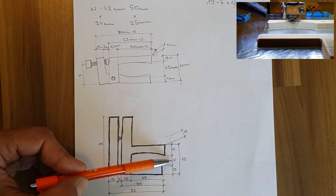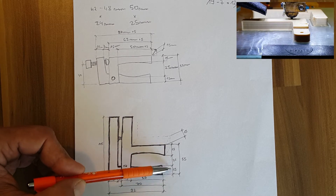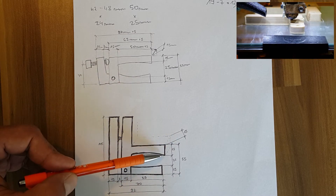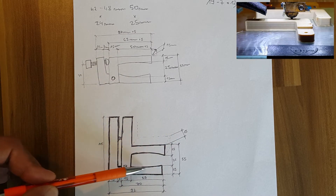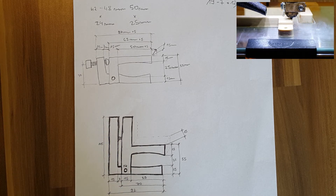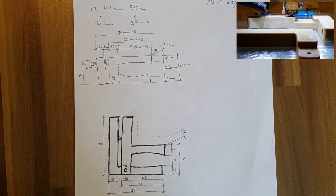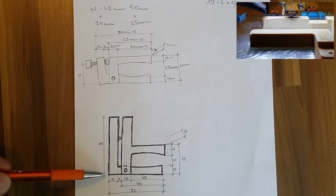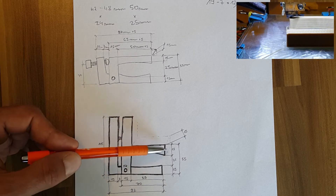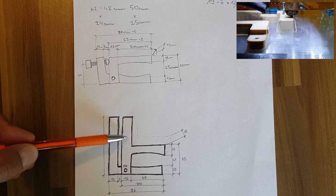I put the arms 25 millimeters apart. Each arm is set to 15 by 15 millimeters. On each arm on the inner side I set a different radius, so the capo would fit different guitars and the whole neck if necessary — just flip it around. The handles are approximately 10 centimeters long for better grip. Most edges are smoothed in FreeCAD for ergonomic reasons. There is a small spring which tightens the capo grip.